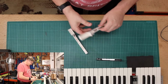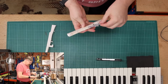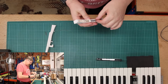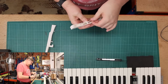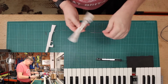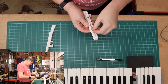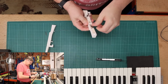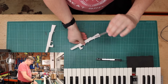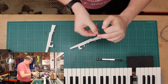And then we need to do the same on this white key, take out the spring and just insert the spring. It needs to go, it's the wrong way around. That's why it's not working. So it needs to go under there and onto there. So actually, if I take this out again, you can see that's the right way around because it's got the black marker. But if you look at this, there is a notch.